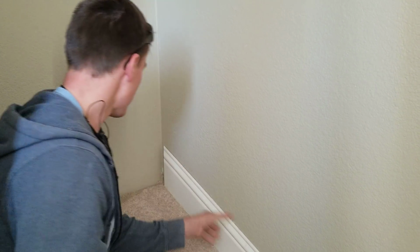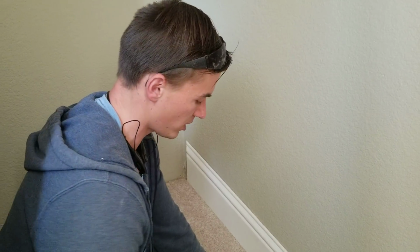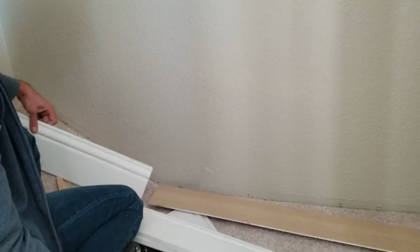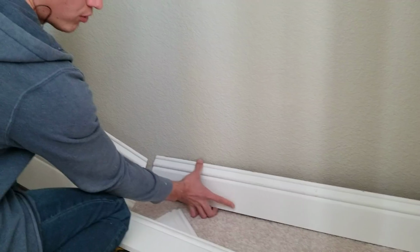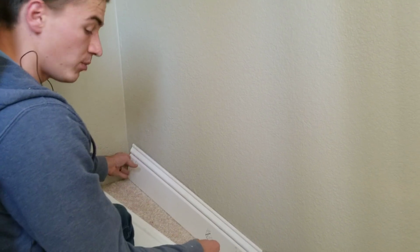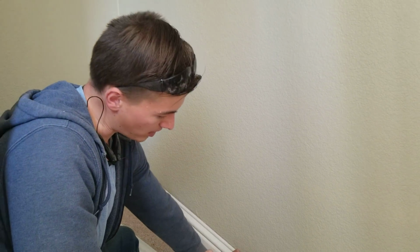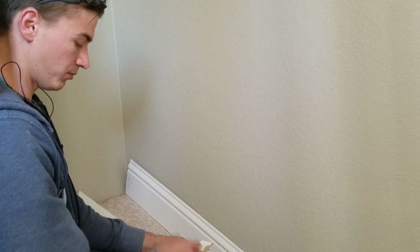No, you're gonna watch this video and you're gonna realize this is actually much simpler than you think. Remember when we did this here at the bottom when I joined the two boards? When I joined the two boards, I did a 15-degree cut. 15-15, we went up. For me to join those boards, I need to do another joint. And the reason I'm doing that joint is I need to bring it from upslope back to a normal slope.